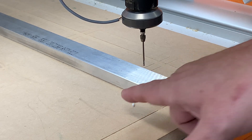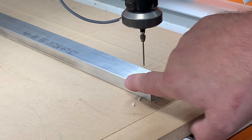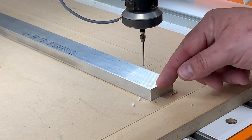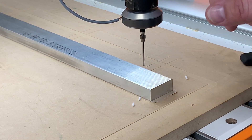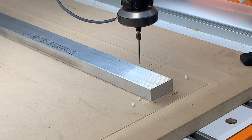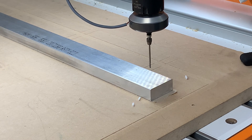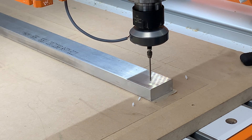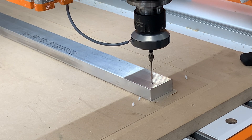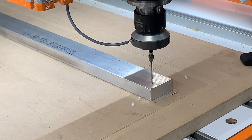You could do it by hand by simply using a piece of paper and bringing the end mill in to touch off on X and then bringing it around to touch off on Y, but this makes it so much easier. All I need to do with this probe is move it roughly above the surface in the corner of the material, within a half inch of the left edge and the bottom edge, so the probe is located just above the material in the corner.